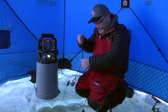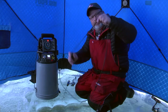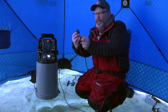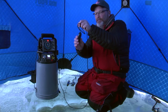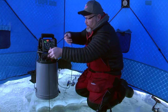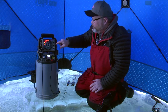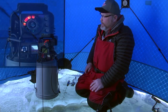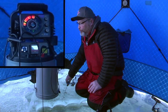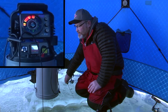So what I've done is drilled a hole. I'll take my transducer and flex it a little bit like this to make sure it's hanging straight, because sometimes if it lays curled down the wire gets kinky. You want to exercise it a little so it hangs straight — that's important. Now we're going to put it down the hole, leave our display on normal setting, and there is our target down there at about 8 feet. Now I'm going to start moving the target further and further away from the transducer until it disappears.